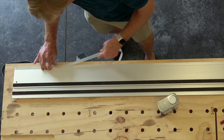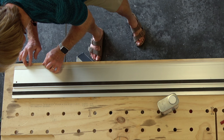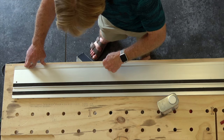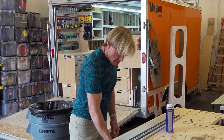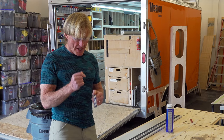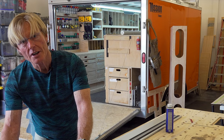I'm going to visually check how much material I have left and decide how far out to hang it before applying the double-stick tape. I don't want to leave extra tape sticking out on the bottom of the track, as it can collect a lot of debris. I'm using what I keep in my trailer — the Speed Tape from FastCap — it's a double-stick tape. The Turner's tape that Festool uses is a little thicker and more fabric, so you don't need to go with this ultra-thin stuff.